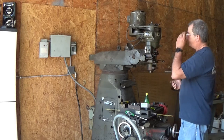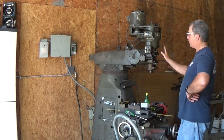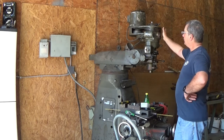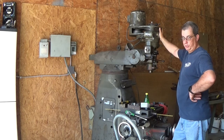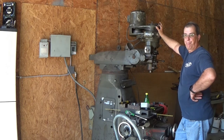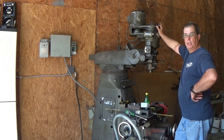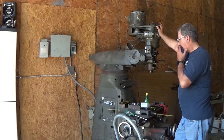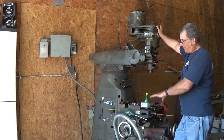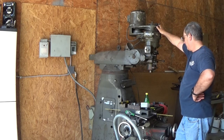There's a little drag in it — that's what the phase converter is doing. It sends a little bit to it to kick it up, but once it starts running it's just running off 220. First time this machine has run in 34 years and it feels good! I'm pretty stoked. We'll get the bracket finished up, get things cleaned up around here, hopefully get the rotary converter in, and once that's mounted we'll have true three-phase. I can bring the lathe in and get it wired up — I've been waiting a while for this.